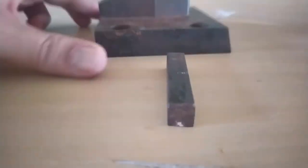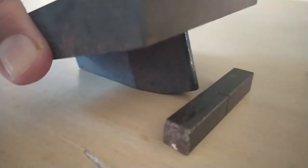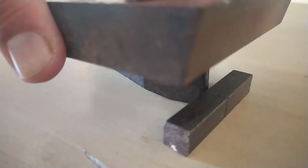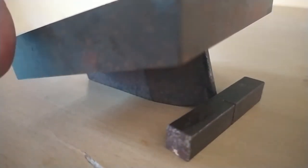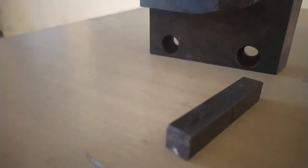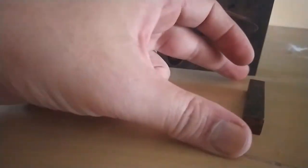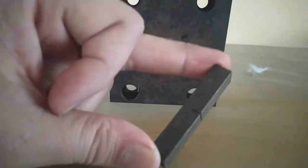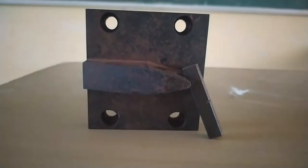With the groove in that format, the striker will come and hit in this direction. We need to understand that the striker is going to hit at exactly the midpoint of the specimen — the striker falls and hits in this way, and that is the Charpy method. We need to place this striker in the impact testing machine and place the member in the simply supported form. Let us go to the instrument and do the experiment.